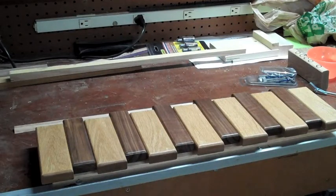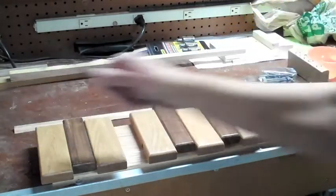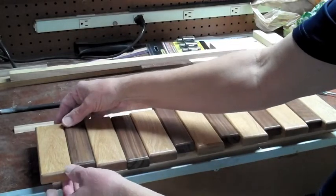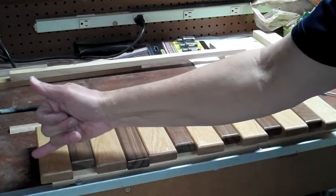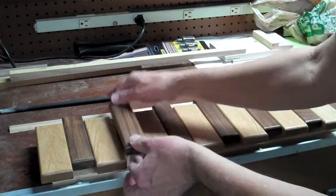After cutting those long pieces to one and a half and two inch widths respectively, I went to the chop saw and cut the lengths down to six inches. These are rounded on the edges. I found the pivot point was exactly where the crease is, so I ran an aluminum rod through the holes and lined it up. I carefully measured an inch below and an inch above, drew a line at that pivot point, then drilled — only halfway through on the two end pieces but all the way through on all the middle pieces.